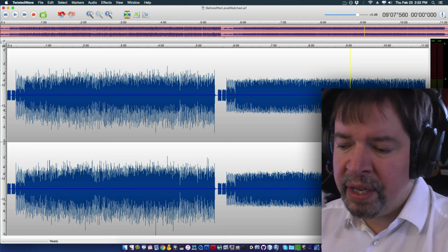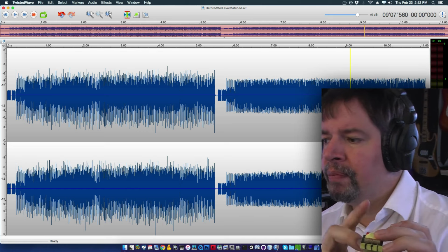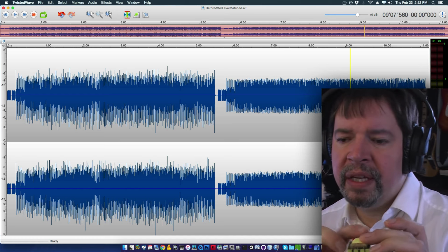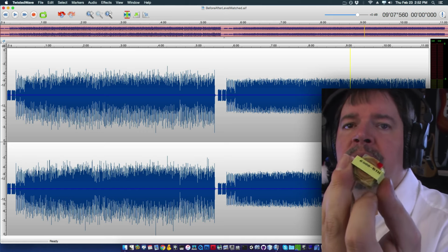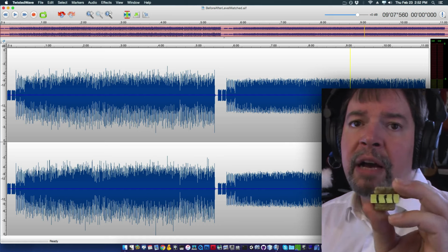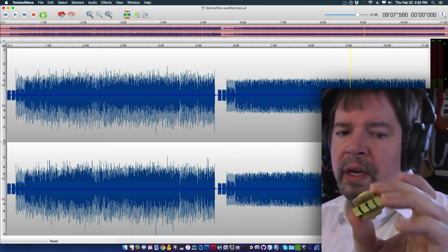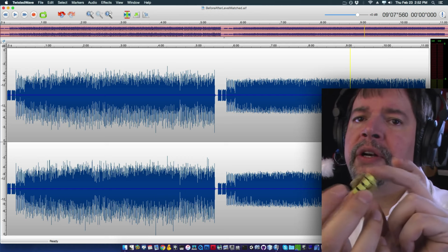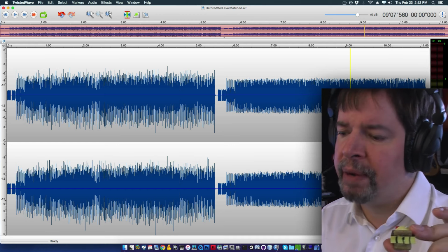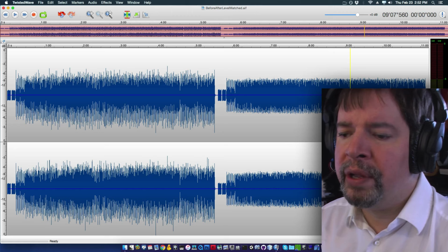And my assumption there is that both of the signals, the minus and the plus of the balanced output, were driving it in the same direction, and the transformer was driven in such a way that this third one, you could take an output off of that because it was being driven by balanced wires, not just a single coil, but two coils, and they were both in tandem. They were both kind of driving the transformer the same way. And that's why that orientation of the wirings was much louder.